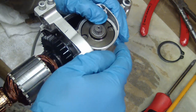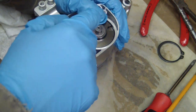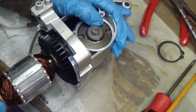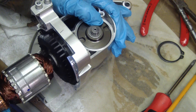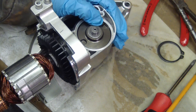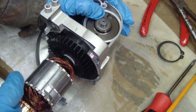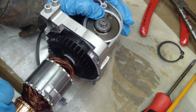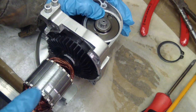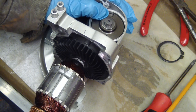We're going to check the gear ratio. This output's at 4,500 RPM, so I'm guessing the ratio is actually quite low, probably in the 2 to 3 range. Five — five and a quarter to one. My mistake, a little bit off. So that's pretty incredible, because 4,500 times five is almost 20,000 RPM this thing turns at internally. Crazy.